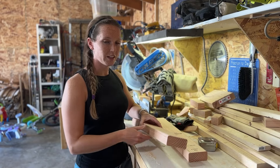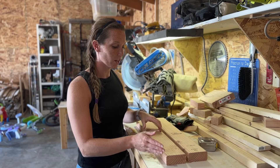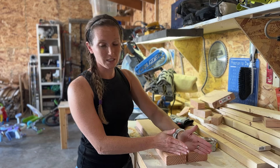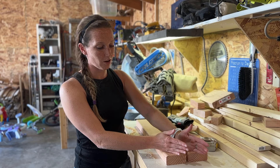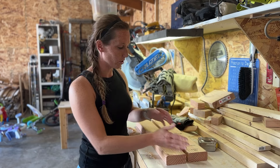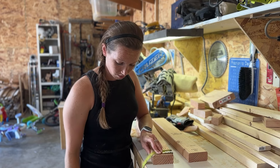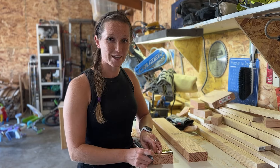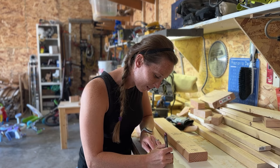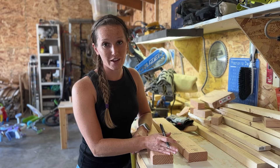The other kind of different angle cuts are for the tabletop supports and then the seat supports. All I want to do is just cut the corners off of them so that it's not quite as sharp, because that's going to stick out right under the tabletop and the seat supports — just to make it a little bit smoother. So I'm just going to measure about an inch down on each one and then I'm just going to cut this corner off at 45 degrees.